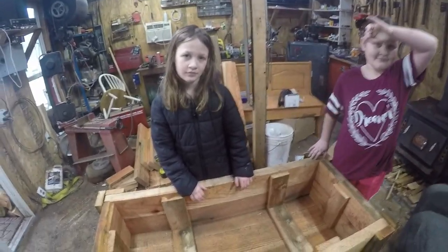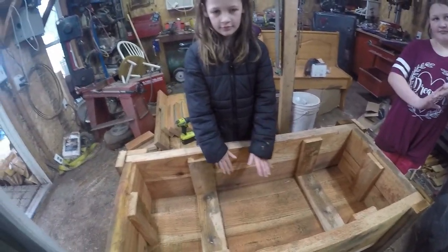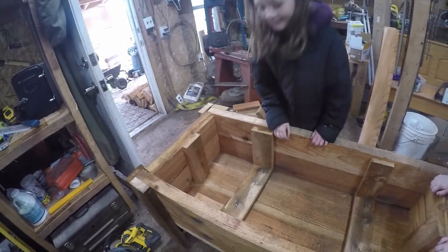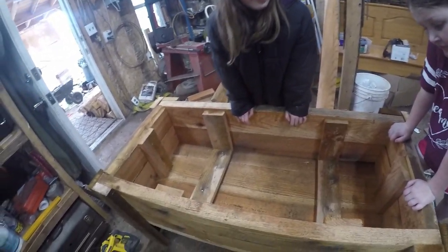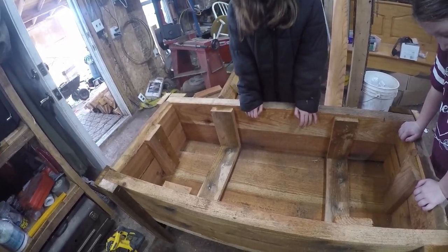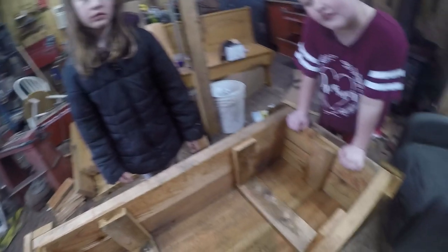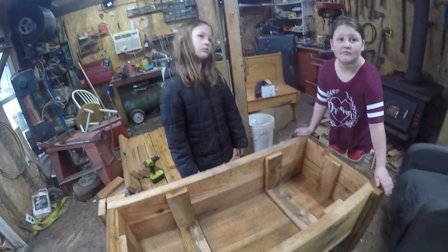This is the finished product. So it's about 2 feet deep, 4 foot long, 2 feet high. So there's plenty of reinforcement, but when you're doing this with preschool kids, that's kind of why I did the L legs and stuff, is you got to figure they're going to push on it, pull on it, climb on it, yard on it. So you want to build it pretty stout. So plus by building it out of 2-inch material, it should last a lot longer.